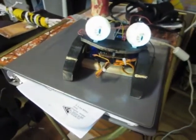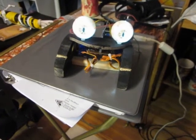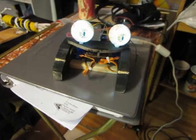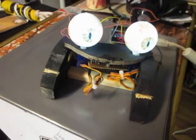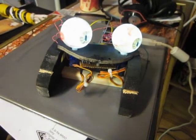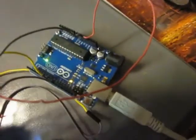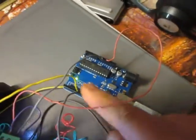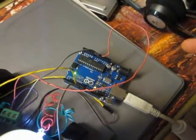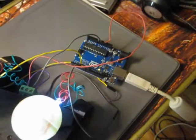The eyeballs go to the zero position and then they are synchronized and stay together. Right now they move three times faster in one direction than the other. The ultimate idea is to have a sonic sensor locate and follow people around to make them think that Tiki is watching them. At the UNO end, only two PWM signals — one per eye — plus a single wire for 5V and a single wire for common are connected, so the wire count going to the whole assembly is only four, which is very good.